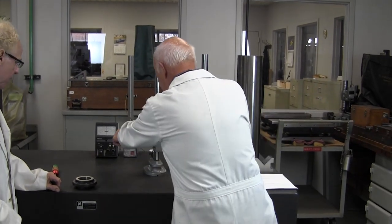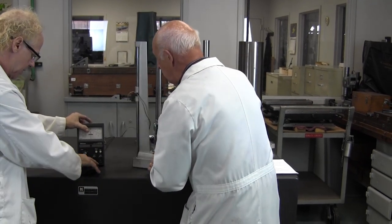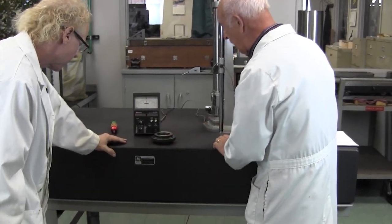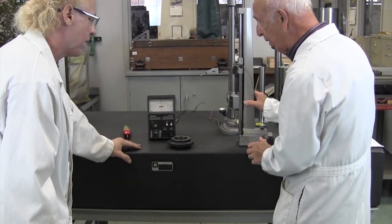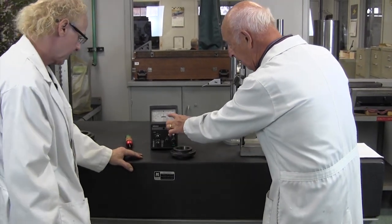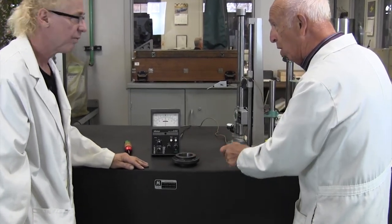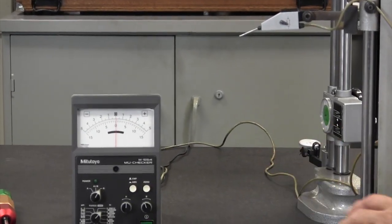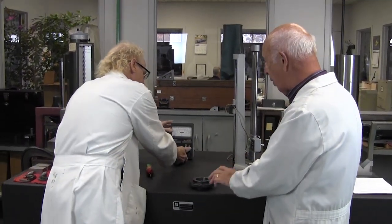This is another electronic one — the same idea. We'd have to have some way to bring it from here to here. There's no readout on here and it doesn't go that far. It doesn't read in inches — it reads in 50 millionths or thousandths. So we have to have what I would call a gauge box, or some way to establish it. We'll get into the gauge box in another video. So this is just another idea of what I call reference measuring.